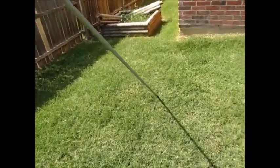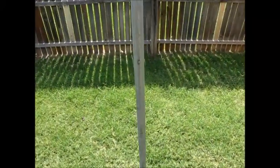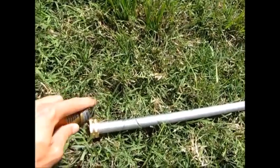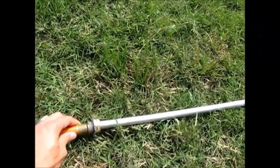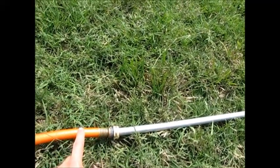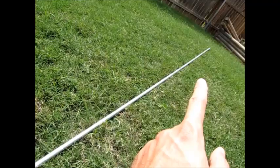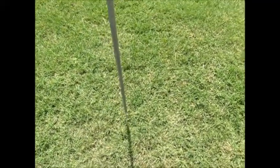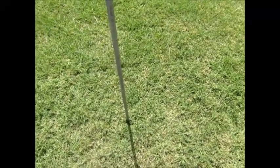Basically what you do — this is a ten-foot section, so it's more than long enough for the typical eight-foot grounding rod — is you attach a garden hose to the end. I can't demonstrate it because I need a hand for my camera, but you attach the hose here, and when you turn on the hose, you can use water pressure from your garden hose to basically bore out a hole in the ground. You may need a ladder to do this. You get the water going, it'll start gushing out the bottom, and you push it up and down in the hole. Every time you go down, it'll go down about an inch.